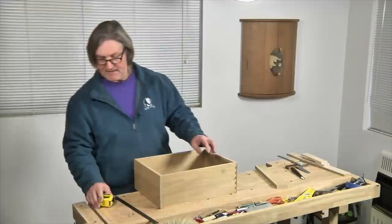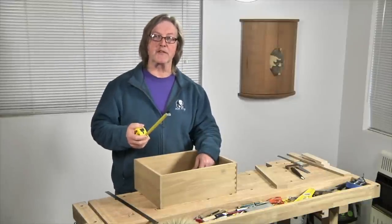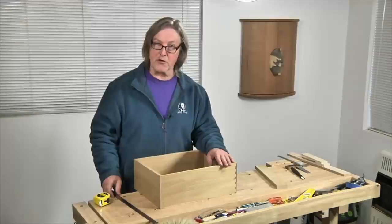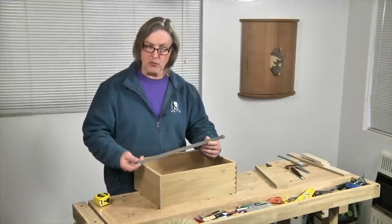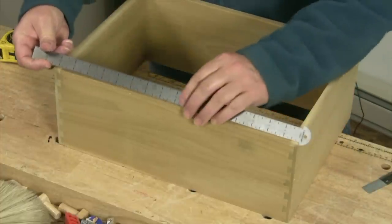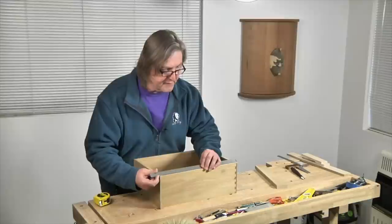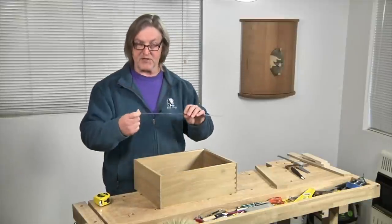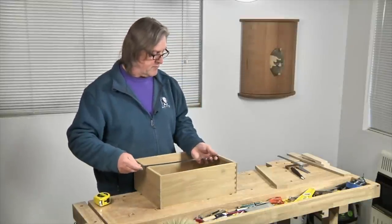The regular carpenter's tape measure might be great for some projects, but when I'm building a fine piece of furniture or cabinetry, I like to have maximum accuracy. A hook rule can give me that. As its name implies, it's got a nifty little hook that references to the edge of a material and lets you quickly and very accurately get a precise outside length.